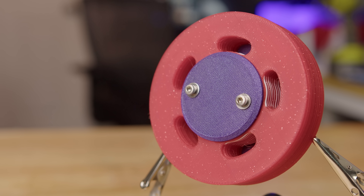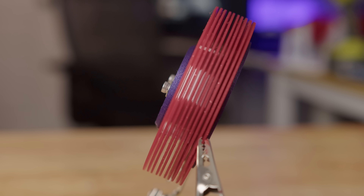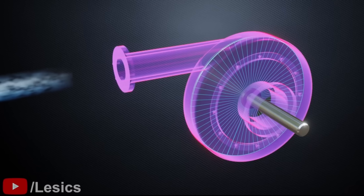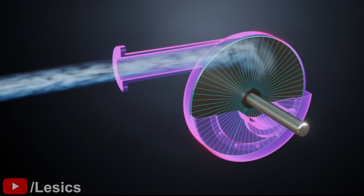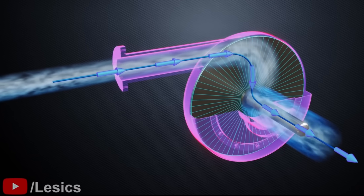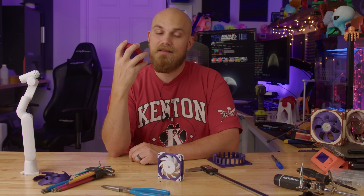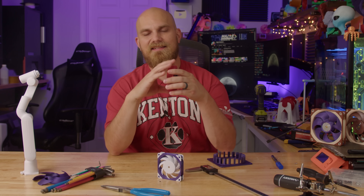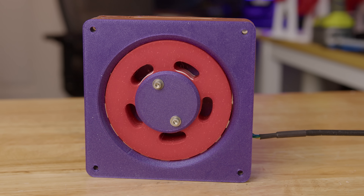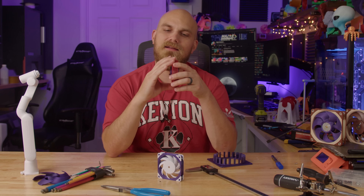The Tesla Turbine did the same thing in a slightly different way. Instead of tiny fins, it had rotor discs stacked with spacing of about 0.4 millimeters — determined to be the best spacing for steam. Steam was piped in at the edge of the disc, and as it moved toward the center where it was exhausted, it dragged the disc along with it. As speed increased, efficiency went up, and those discs turned a shaft and generator. The problem is the Tesla Turbine needed to spin very, very fast to be efficient. The faster it spun, the more centrifugal force was imposed on the discs, and eventually they would just rip apart. Modern steam turbines are in the high 90th percentile for efficiency, so there's no point going back to this — but they're cool.